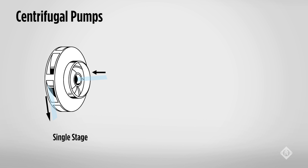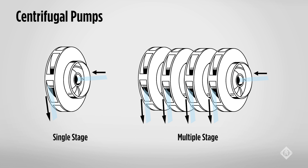This device can be used as a single or multiple stage pump. Each stage has its own impeller. When used in series, large amounts of pressure can be generated at the required flow rate. Pumps can be hooked in series or parallel to either increase flow or pressure. If hooked in series, the case pressure capability must be noted to ensure that the sum of the pressure the two pumps can generate will not exceed the case pressure capability.